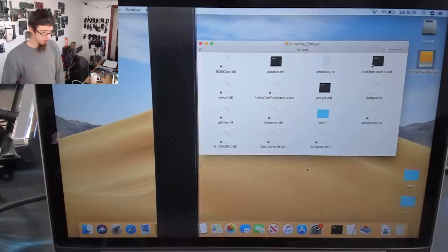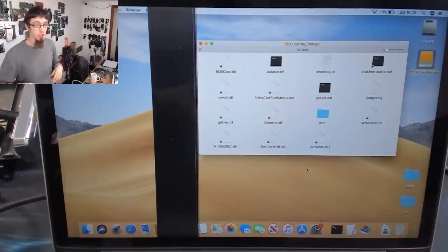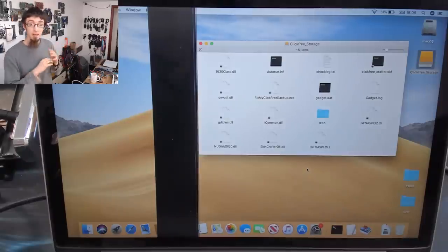Again, if your drive has got bad sectors and stuff like that, you may not have had quite as smooth a process as I just had. However, as you can see, we had a drive that appeared to be totally dead and a laboratory job. When I first saw that short circuit on the drive, I was convinced. I was like, nope, I'm done. That's got to go off to a data recovery specialist, which I am not. However, as I say, with just a little bit of poking around, we actually found a very simple solution. And then using TestDisk, we can restore the lost partitions to get the drive readable again. And that's how we've now just apparently completely recovered this drive.